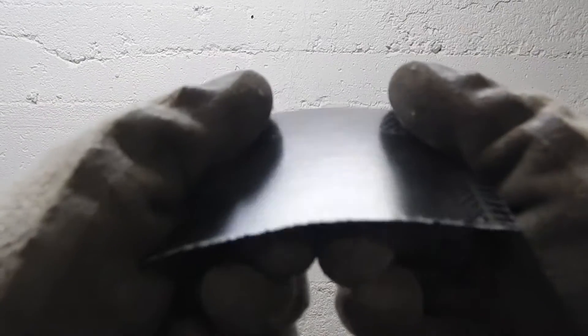Here's an off-cut. You can see that edge where the two plies stuck together and also where there's a single ply. It's interesting stuff to break — it doesn't break the way you'd expect. The interface where the Z-axis fiber is stays stuck, and it really just tears the woven apart. So you don't ever see a bond line failure. In my couple of breaks, it was always just tearing the woven apart — so definitely tougher than just two 400 gram woven plies stuck together.